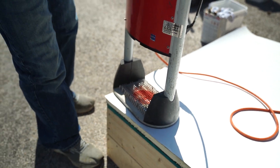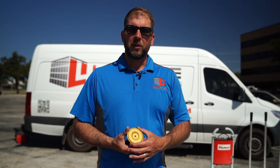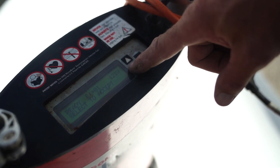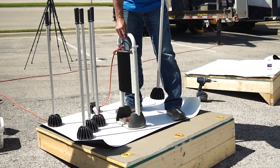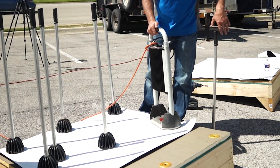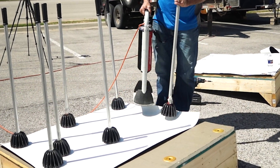One of the biggest things I see in the field is installers who don't want to use the Rhino Bond because they think it's too technical, but it's really quite a simple system. You set the machine with the red circle on the plate, push the button, it senses the plate below, and starts the induction heating process — about 10 seconds. Then you remove it, put the heat sink magnet on to draw out the heat, and move on. You can play leapfrog with magnets: by the time you're done with your sixth magnet, your first one is cool enough to transfer. The benefits include less waste, far fewer membrane penetrations — and thus fewer leak potentials — and simple operation.